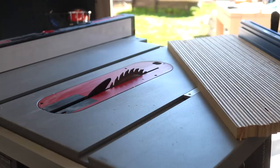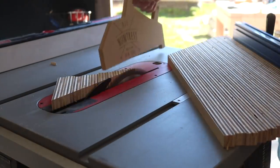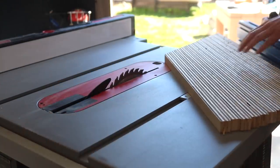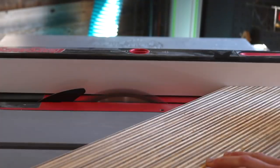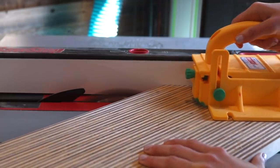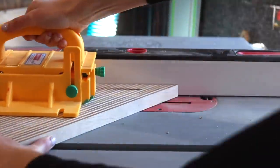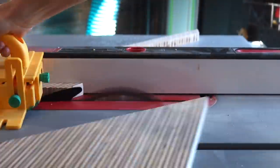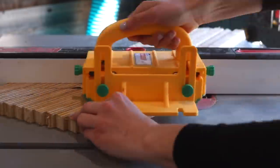A while back on Instagram I shared a chevron patterned plywood thing that I was working on — that's a project I'll be releasing later. Because I had already known how to do that, I had a really easy time cutting this plywood into the next set of strips. In order to make this chevron pattern, I needed to cut my plywood panel at 45-degree angles. I started by making my first cut with my miter gauge on my table saw and then cut the rest of the strips at one inch increments using my push block as well as the table saw. I was super grateful for the push block at this part because without it, those little pieces between the fence and the blade could have flown back and hit me. So if you're cutting small pieces on your table saw, you will definitely want some sort of push block or push stick.